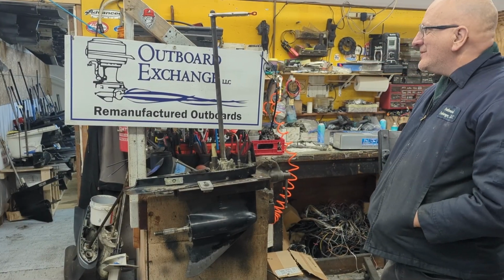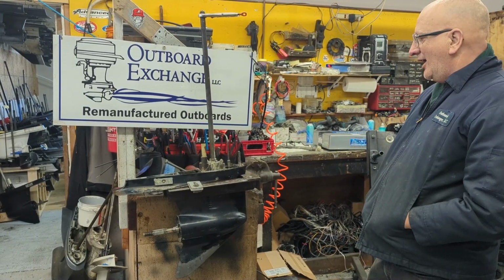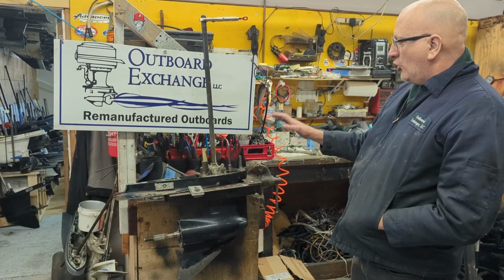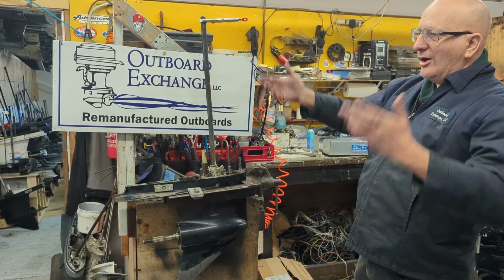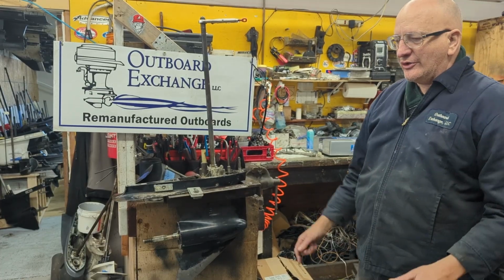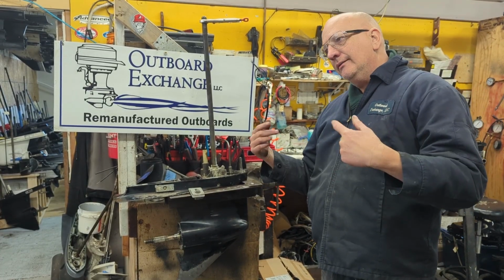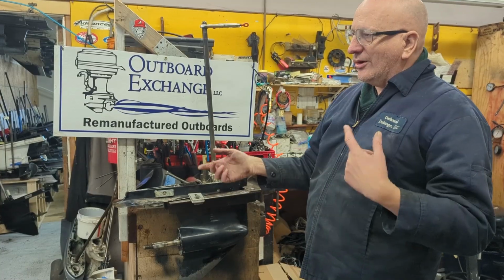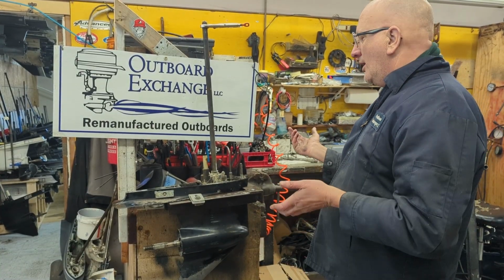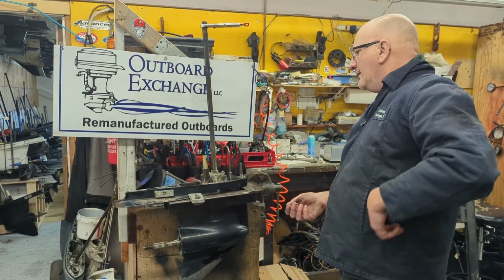We are actually prepping some blower units for sale. And a lot of people don't know, blower units as a whole will fit on a motor, but they have different ratios. And ratios are like gear ratios in the rear end of a car for your car guys. Some are 4-to-1. These are usually like 1.5 to 1 to 2 to 1.